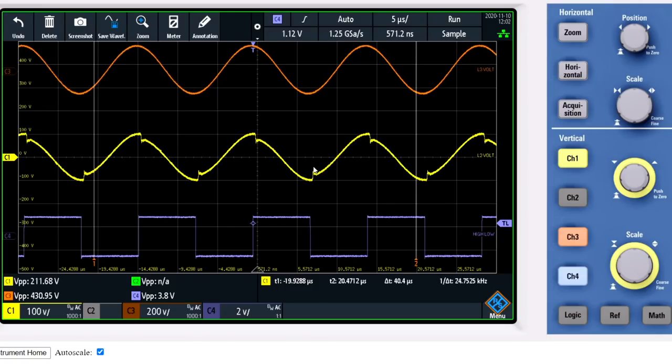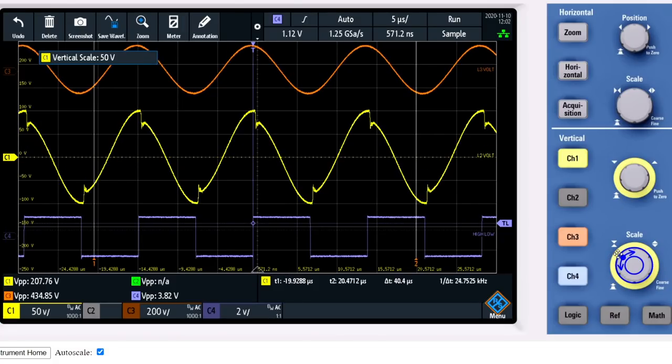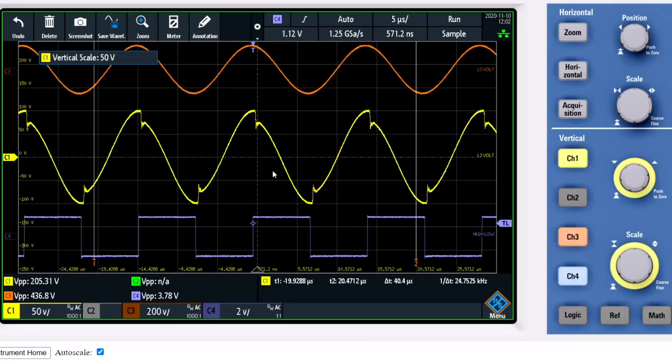You can't see this impulse right now. I'll show it a little bit later. So L2 is being discharged because it is out of phase. And that is an anomaly I can't explain. This only happens when L1 and L2 are close coupled. Normally, the voltage sine wave will be 180 degrees out of phase, giving a positive maximum when the positive impulse is created.